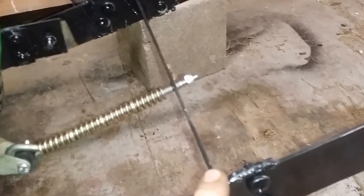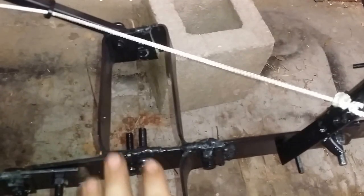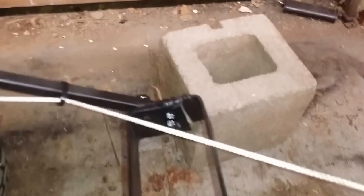There were 15 in total with the dog ears before I bent them. So it's about 13 inches wide at the frame rails. Over here, both of these are about 5 to 6 inches long and bent over. I welded these, really welded the mess out of this section, because this is holding all the weight of the thing when you're lifting and lowering it. So you need to make sure this piece is very secure. So welded all of this up and it's bolted.